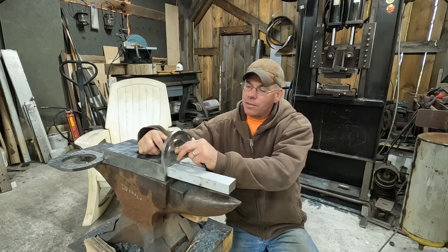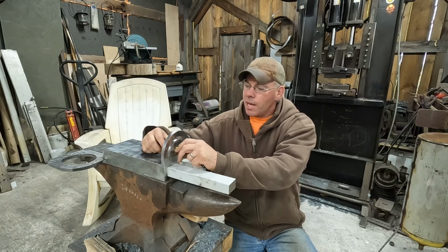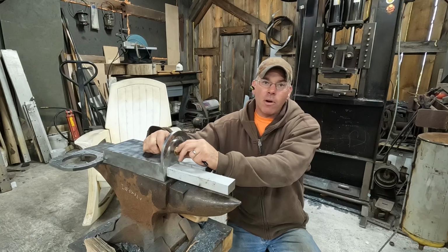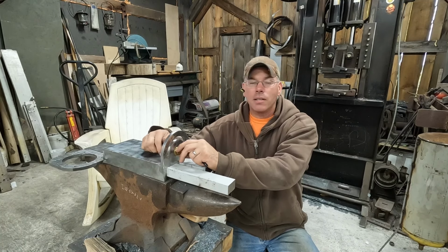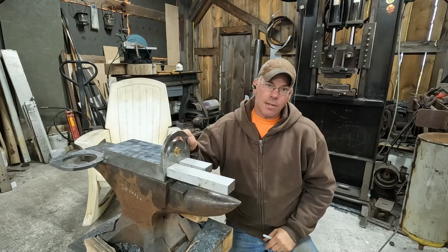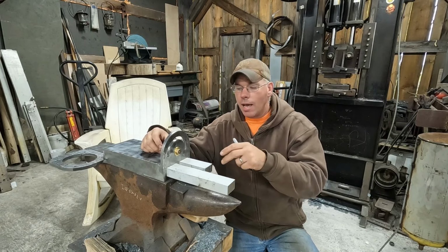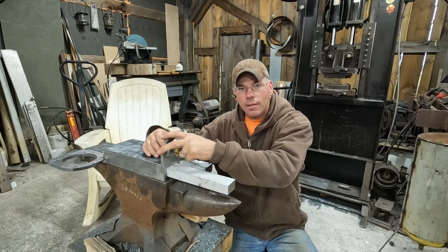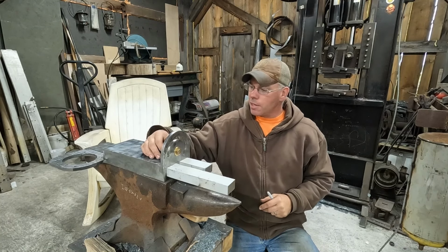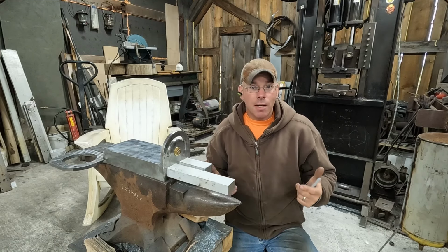The important thing I need to do here is make sure that my center's on this bolt. We're using a 1/2 inch grade 8 bolt for the pivot points with the nylon lock nut on it so that we can have it snug but not so tight that we can't turn this easily. We'll have a washer spaced in between the actual pedestal of this and these pivot points, to give a little bit of clearance there.